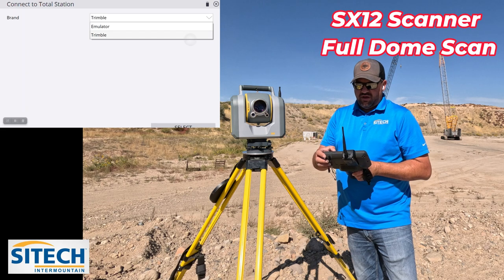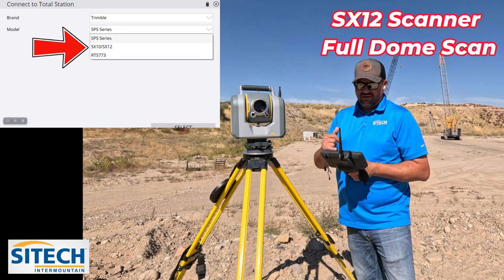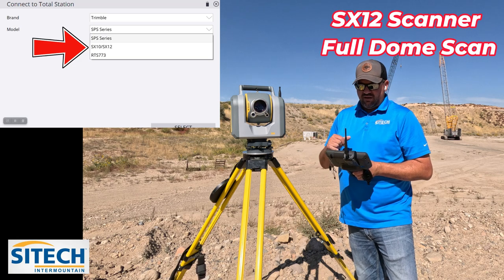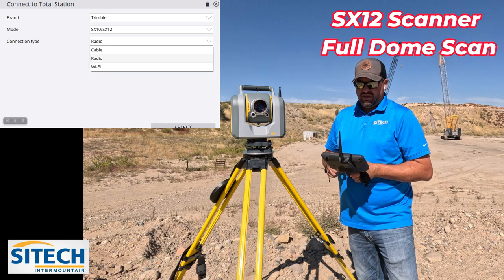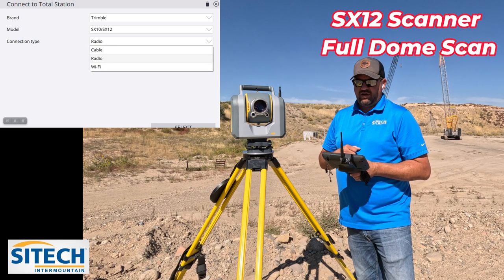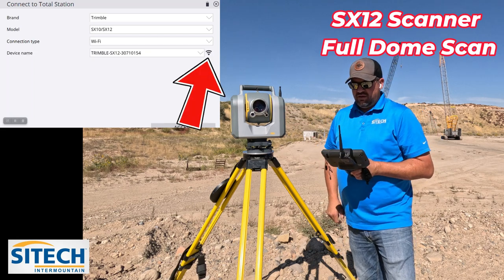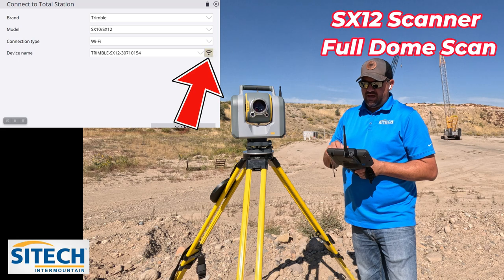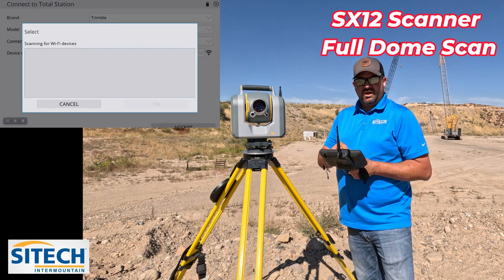So in here, you've got your Trimble, and we're going to go SPS series and then down. So if you've connected any others, keep in mind that you've got an SX10 and an SX12 option in there. So in here, you've got radio and cable and Wi-Fi. Since I don't know what the radio channel is, we're going to go Wi-Fi. And we're going to go ahead and scan with this little option on the side right here to see what's here once we actually turn it on.